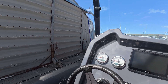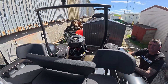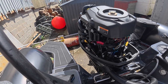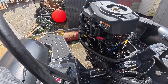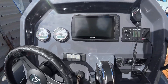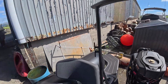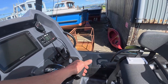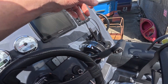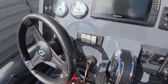Looks like the trim needs calibrating, so we'll calibrate the trim. In the meantime we just want to make sure the engine's running okay — we've got a good water supply, although we've not had the gear blocked off so that doesn't matter. I'll just check the gear shift operation. Forward gear — yes it is. Reverse — good. Engine stop. Kill cord's working.